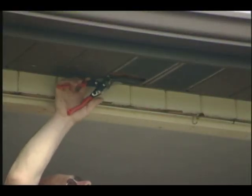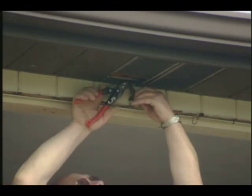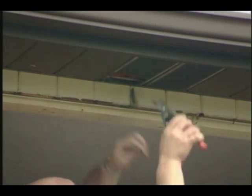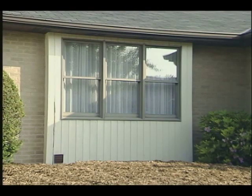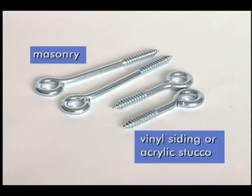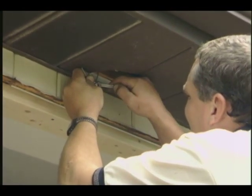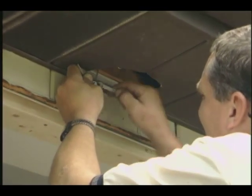Next, prepare the opening for attaching the cable anchors. In this case, they will be connected directly to the rafter tails. In other situations, they will be anchored with eye bolts to the vertical plane of the wall. Use long eye bolts with masonry facades. The shorter eye bolts are for use with vinyl siding or acrylic stucco facades. Loop the cable around the rafter tail and secure it with a cable anchor clamp.